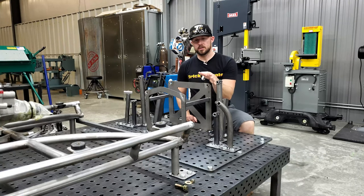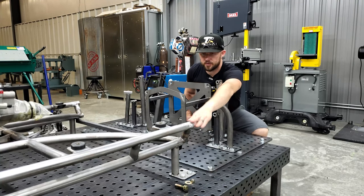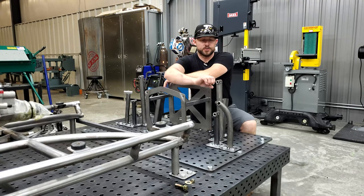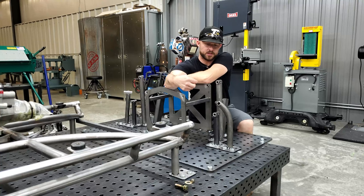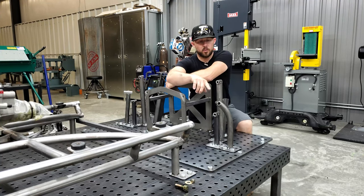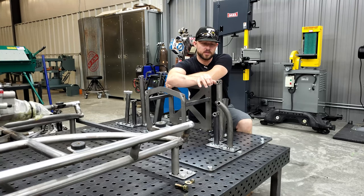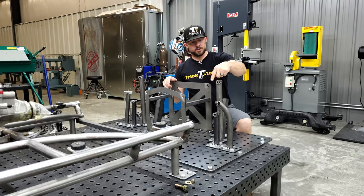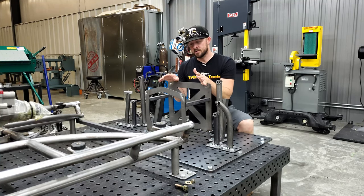So I was working on laying out some of the basic parameters of where I want the tubes — measuring the heights of the existing frame rail from the table, which represents the ground, and how far I want the new frame rail height to be through this area. The tube's going to have to bend up, come up here, then make another bend and go back flat. I'm trying to make sure it's flat through here to have a nice, straight, easy mounting place for the brackets. At some point the tube is going to come across the back and I'm measuring all this to hopefully make this all out of one tube. That's going to be the goal — it'll be a pretty complicated piece with about six bends in the whole piece.